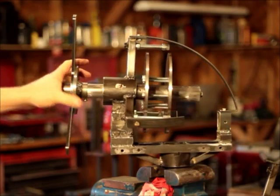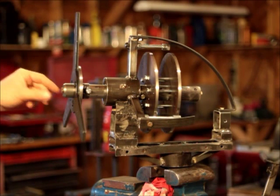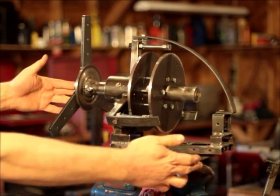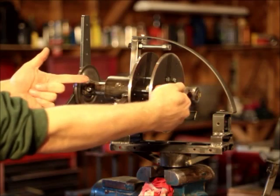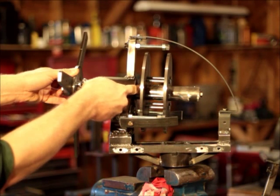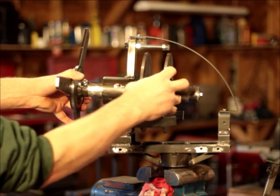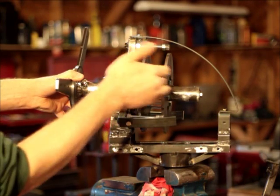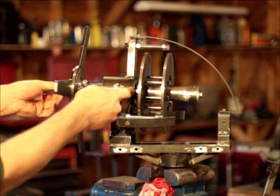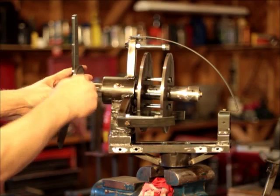There are a lot of other possibilities — clockwise, counterclockwise, whatever you want. This is a clockwise thread. Basically a 5/16 coarse thread going down into both spindles on that side. When you pull this together on this side, this collar is fixed with that screw going all the way down into the shaft. Then when you pull this together, it pulls the plates and spacers — there are two spacers and that little end piece — all together. On the front side it pulls the bearing races, the spacer between the bearings, and the races, pulling it all together. Then you can lock everything down with set screws.